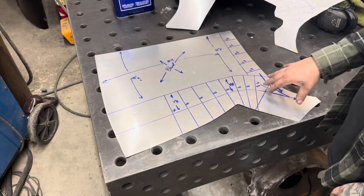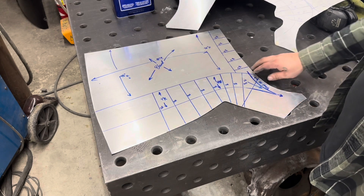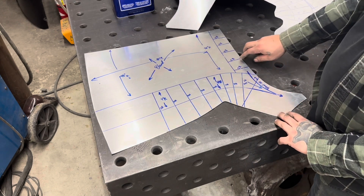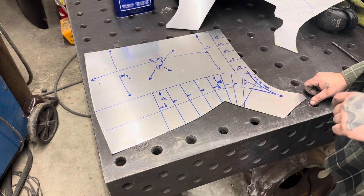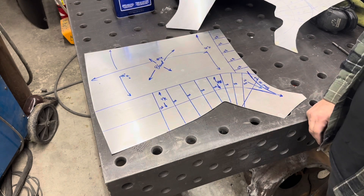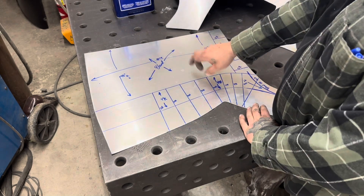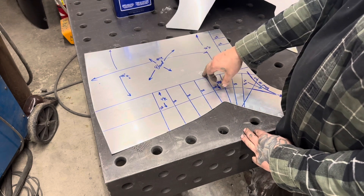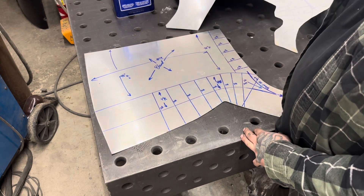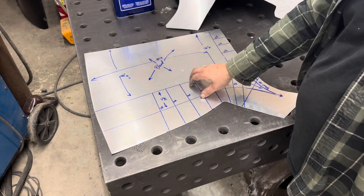First up, we're going to go to the MH19 power hammer with the small thumbnail shrinking dies and come in and put these light shrinks in — that'll be in this video. Then in the following videos, we'll do the larger power hammer with the larger shrink dies, and then again the larger power hammer with a 36-inch lower radius die and a flat upper to kind of raise this low crown. There'll be a little bit of wheeling machine work in there as well to tighten this radius up.